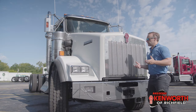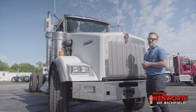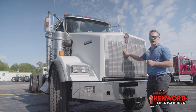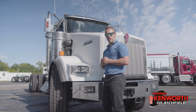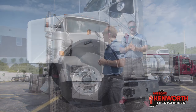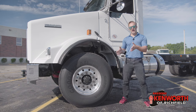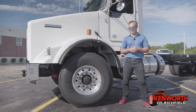When I start talking about value in this truck, there's just the Kenworth tradition of high quality, and quality in most cases equates directly to value. We've got the added bars in here so it looks nice, metal mesh grille with the screen in there for added protection — why not protect your expensive radiator and other coolers? There's the traditional four-headlight setup for the T800. Behind that, we've got the 15-inch polished air cleaner. On the other side we've got our 425 wide-base Goodyear tires, Alcoa DuraBright wheels — value, but not cheap. Inside of that we've got drum brakes, a 20,000-pound axle, and 20,000-pound suspension.